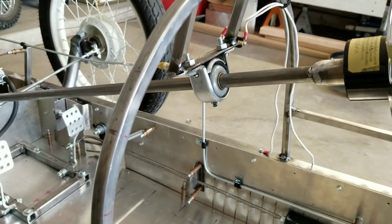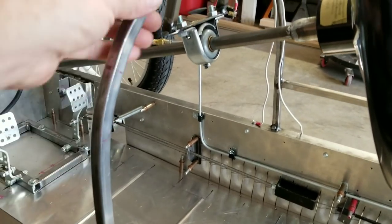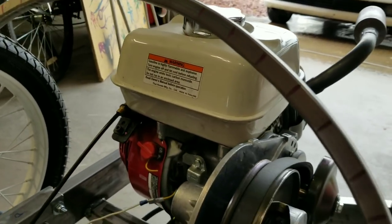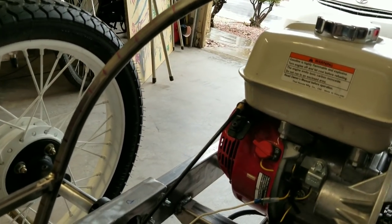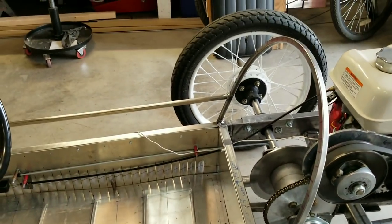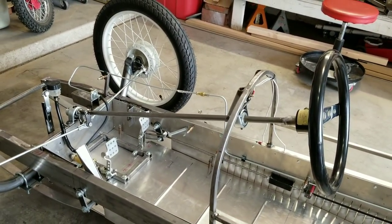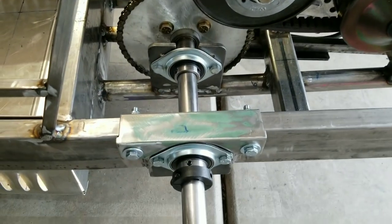I've got a Harbor Freight floor mount metal bender I used for the first time. That's how I bent these tubings. It's not really designed to bend tubing. You can see on this, I put little hash marks about every inch all the way around it so I can keep track of where I'm bending. I just very, very slowly bent it, kept going around and back and forth. And I just used a piece of plywood to make sure I got the right arch. So that's the cockpit framing for the seat back, and then the mount for the steering wheel. This way, this car can be completely driven without a body on it. That's the idea. So there's the gussets for the frame.